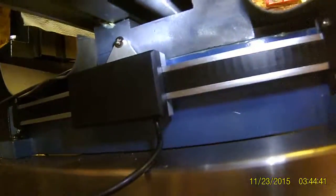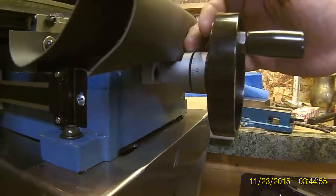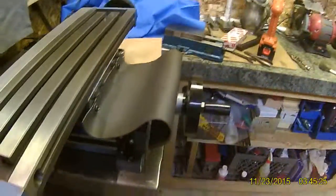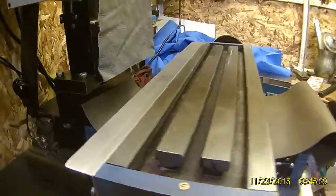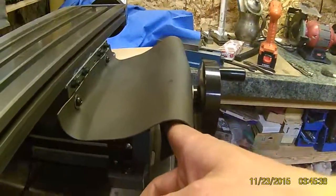I put this axis a little further back. With a little modification you could make a piece that screws on and uses set screws to pull your handle out a bit. On these stock mills, the screw pretty much comes all the way up to the retainer, so you have almost three-quarters of an inch of screw that doesn't get used. Why not push the screw back and get at least another half of that? I went a little long because I could push it back even further. From front to rear it comes about five-eighths inch over each side, so I'm happy with that.